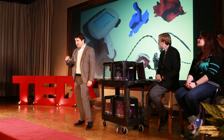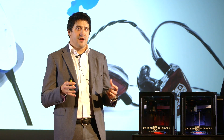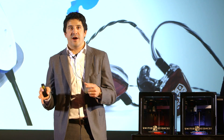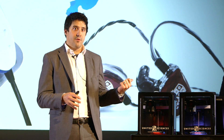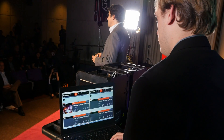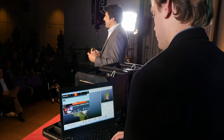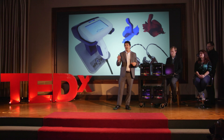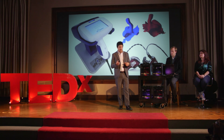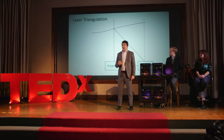Hopefully you can see how computer-assisted craftsmanship can start to change your life. I wanted to give a few in-depth examples of how 3D scanning and 3D printing are already being used in a variety of industries, starting with what we're doing here on stage. Our 3D scanner is three systems in one. The probe is a 3mm diameter probe that goes in the ear and produces a ring of light at the tip, and we use laser triangulation to reconstruct that data.